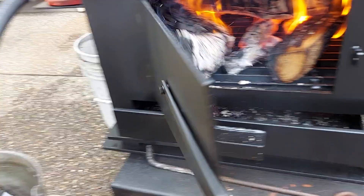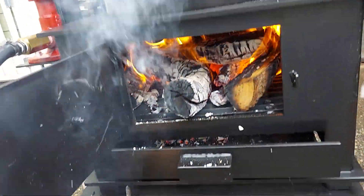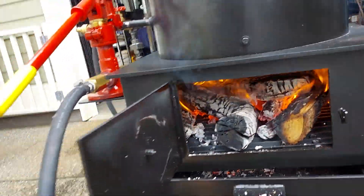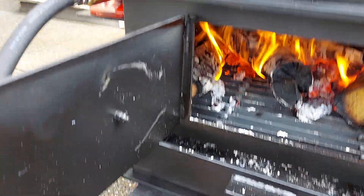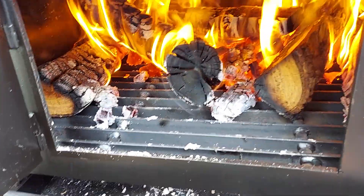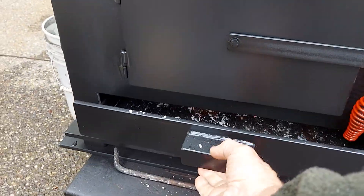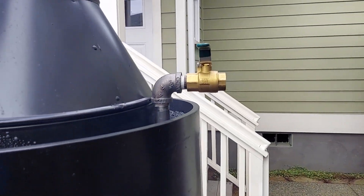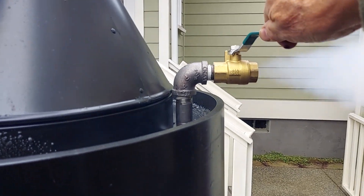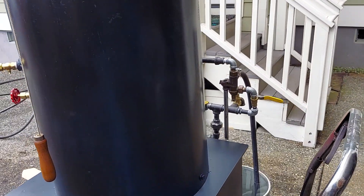Big firebox — 22 square — and an old log coming out there; I've got to move this wood around a little bit. Ash pan is right here, and engine out is back here — it's half inch. Just hook your steam pipe or hose up to that to go to your engine and you're all set.